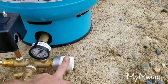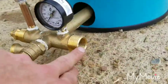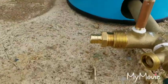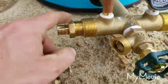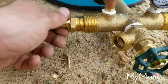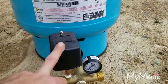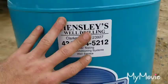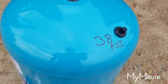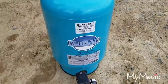When we come into our tank, we have female with the stainless steel ring. Or you could choose to go with a 3/4 inch threaded male and come out and go into it that way. When we leave the tank, we leave with a brass PEX male — that is 3/4 inch thread by a 3/4 inch PEX male barb. We come out of that and go to our filter or go straight to the house. If you run a 40-60 pressure switch, you're going to want to set the air pressure in your tank 2 PSI below whatever the cut-on is. So we set it at 38 PSI. You can only adjust your air pressure in the tank when there is no water pressure on the system — that is very crucial.